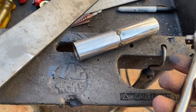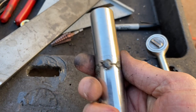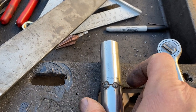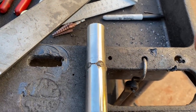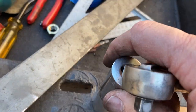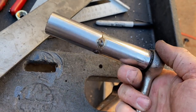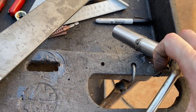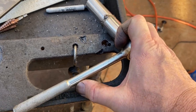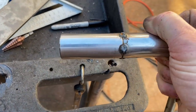One last thing we're going to do — we're going to make a tool custom made for taking this thing on and off. Like I showed you, we've got these two sockets that we welded together years ago. I'm going to grind those welds up a little bit nicer. I think what I'm going to do is take this ratchet — it's some cheap ratchet, I don't even know where it came from — hook it on here, weld it to this thing, and cut this handle off so it can just spin all the way on and off. So that's going to be the tool we make, and then we'll try to figure out a cool way of attaching it to the stump grinder.